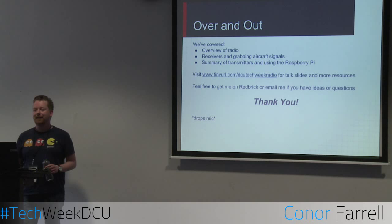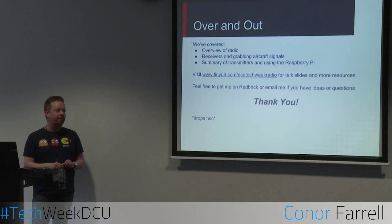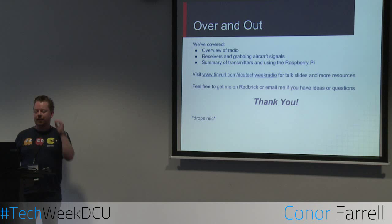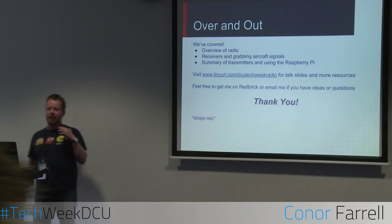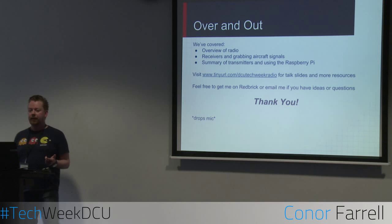I may have missed this, but what is the difference? Why do most radios use FM radio waves, not AM? And what's AM used for mostly? That's a good question. AM radio is probably used a lot by medium wave stations. Those medium wave stations will have a lot of coverage. AM modulated radio waves can be transmitted very far, so it's great for big countries like America, or if you have a radio station that needs to be broadcast over a wide range, that's where you'd use AM. FM, however, is much more localized because FM is a line of sight radio signal.